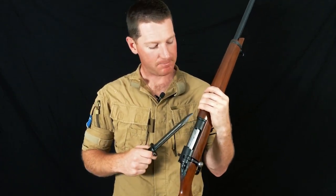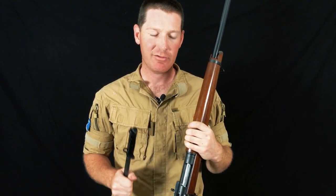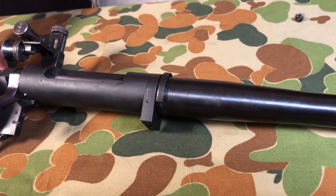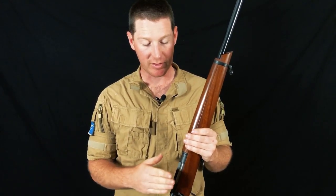Much like the SSG69, which we've also done a video on, you can't really change a barrel terribly easily as it's a press fit. To change a barrel out, you effectively need to machine off the barrel, cut a thread internally, and then screw in a replacement barrel. Companies such as MAB Engineering were the first to start doing that or making barrel adapters, and most gunsmiths in Australia have since cracked that code.